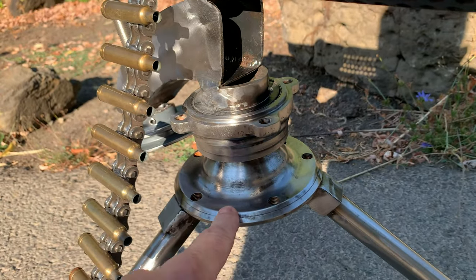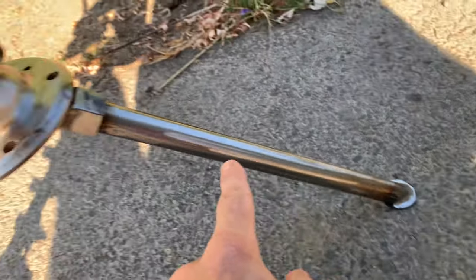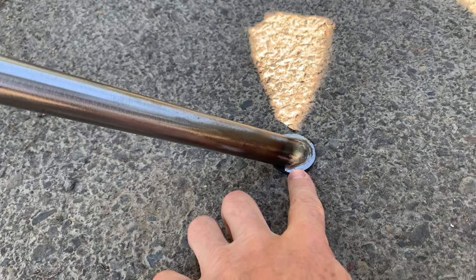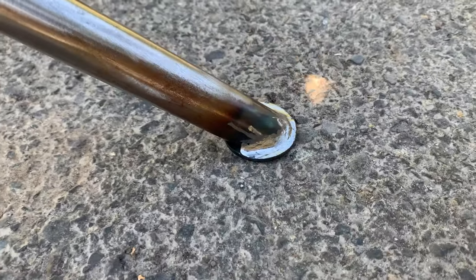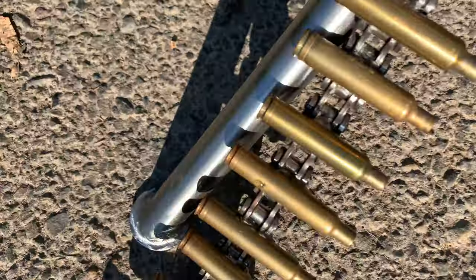This is — what do they call it — a hub off of a car. And then I made this for the stand. My first idea was to use washers — real simple, just use washers. I ground the surface off of washers and put them down there, but there was no way you were gonna weld those — just smoke everywhere. So I had to make three discs out of flat sheet, just make them myself, and then weld them in. Turned out pretty well.